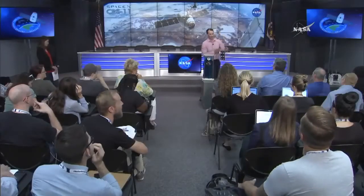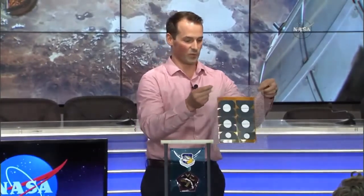A question about the wing that's going to the space station: what is the thickness of the wing when fully deployed? The blanket itself is only a few millimeters thick, even on station. It's a flexible blanket that has to be stiffened by tension mechanics, which is why you need the booms.